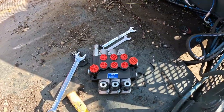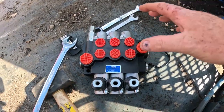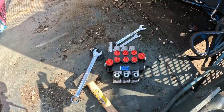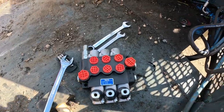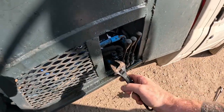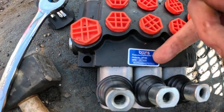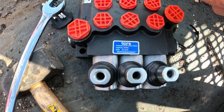Basically you pull this lever and when you're lifting something heavy the engine of the truck cuts out, which is no good. So what we want to do is have it running at the correct pressure so you don't damage your pump. If your truck's not lifting enough or it's lifting too much, this will tell you how to do it. When we look at a valve block we've got three levers — we're going to look at the numbers. We've got a 3P which means three levers, and it's got a 40 which means it will do 40 litres per minute through this pump.